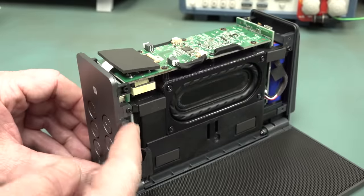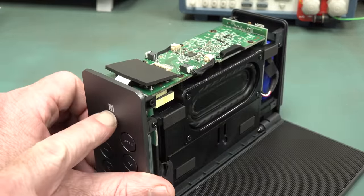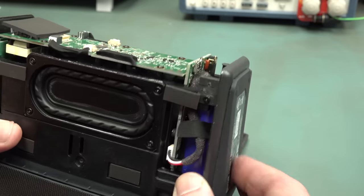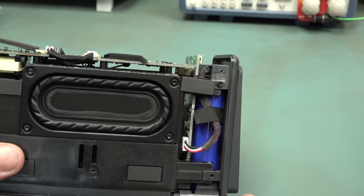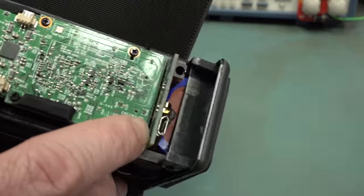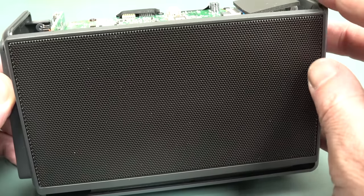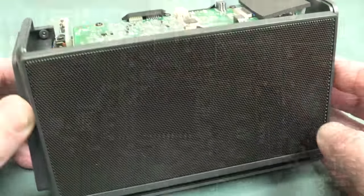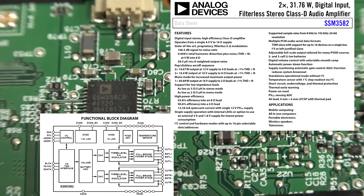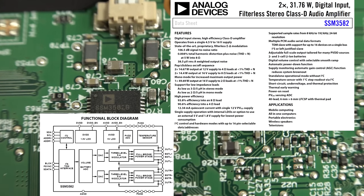We've got one main board here. Looks like we've got another board on the front for all the front panel switches and a couple of LEDs. The NFC near-field antenna is right there where the symbol is, which is how it's supposed to be. Everything's on this one board. We've got our two batteries down the bottom - they look like two 18650s. Got some battery and charge management on the back board. And that's an Analog Devices SSM3582 - that's a Class D amplifier, 35-watt job. That's all there is to the drive in this thing. Perfectly adequate, nice part for the job.